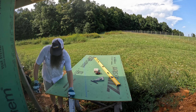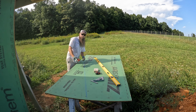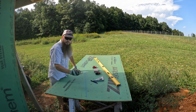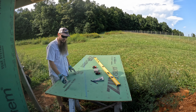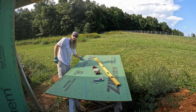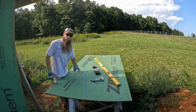With 22 3/4, and then consistently this is a 3-inch addition. 3 inches vertically. It's important to measure the 3 inches in the exact same direction on both ends, because the way I guess the hypotenuse works is, even if it's just 3 inches on this side, it's going to be a lot longer of a difference on this side. So I'm measuring it to the top 3 inches. So now I'm going to go ahead and cut this, and then we'll worry about notching it later.